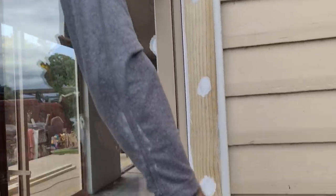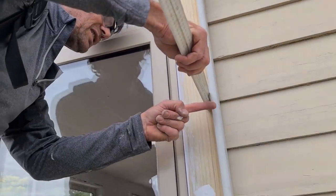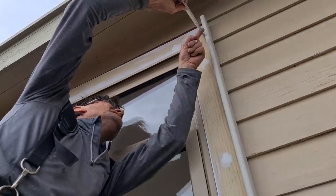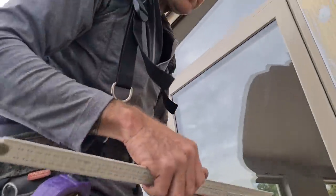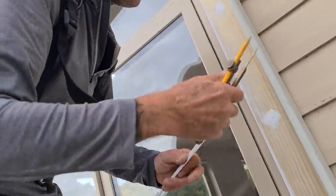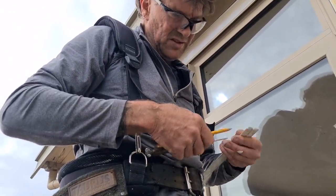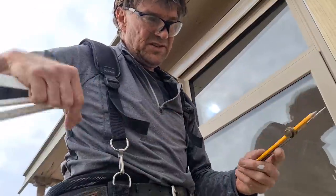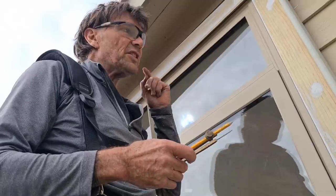So I've got that exactly to the outside measurement is 41 millimeters from here to this outside edge. Right. Now what I want to do is I want to have it about sort of 5 mils back, so it means 41 minus 5 is 36. I'm going to set this to 36 mils. Right. This is 36 mils, exactly.